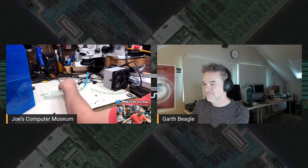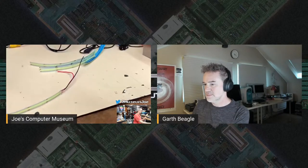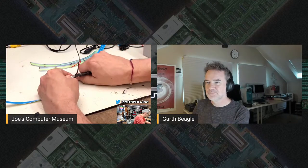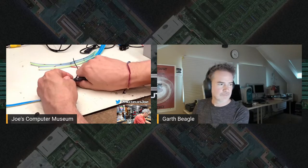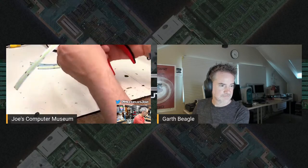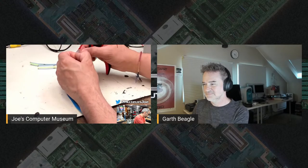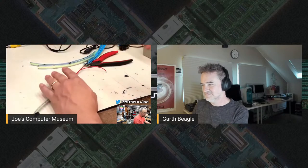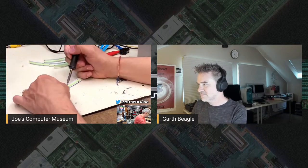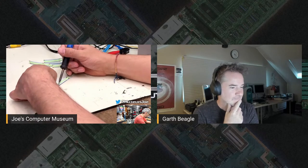So now we start arranging things. First things first, I want to get this little piece of nub off the end of here because it's just in my way. So we just cut that heat shrink off there. That's off. It's underneath the sticky tape. That's smart. Good job, Chinese factory. And then we heat this up and get these little pieces off here, because we're not going to be using this leaded wire. We're using our own wire, which is thinner and looks prettier.